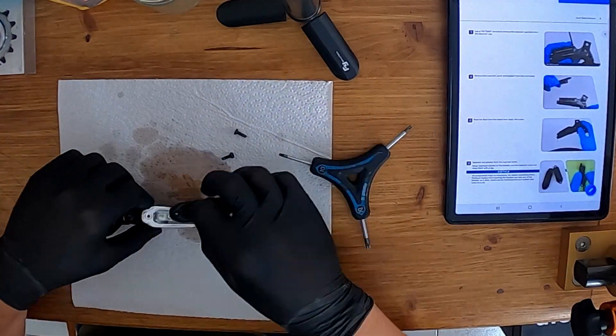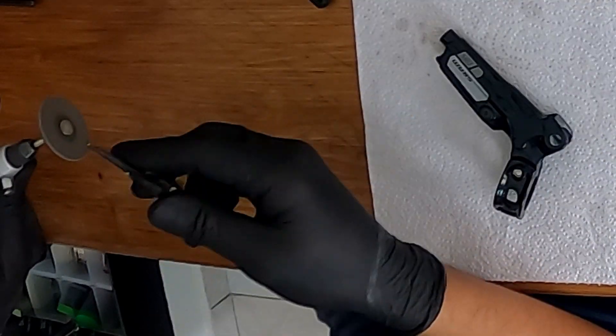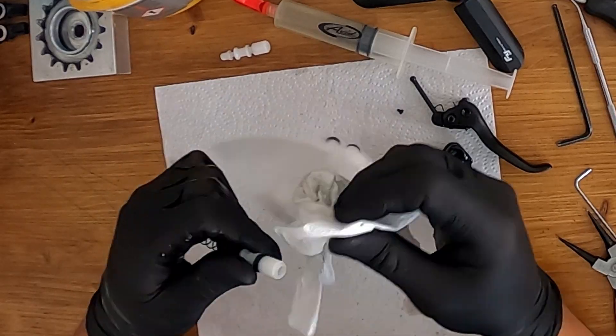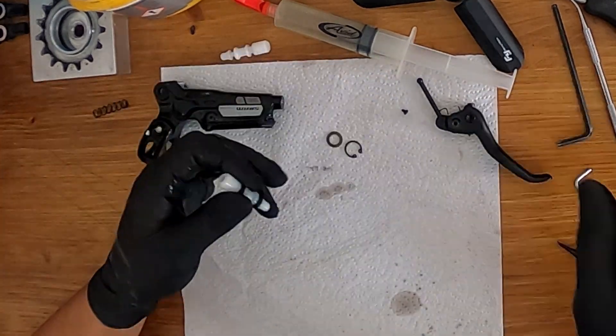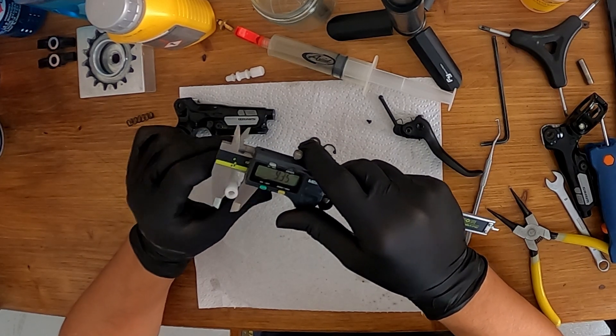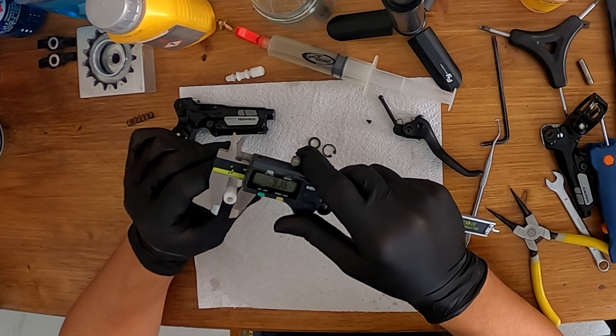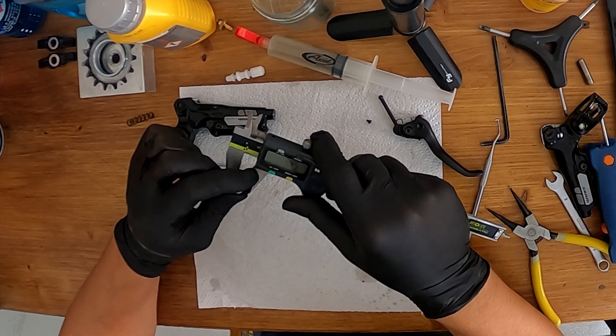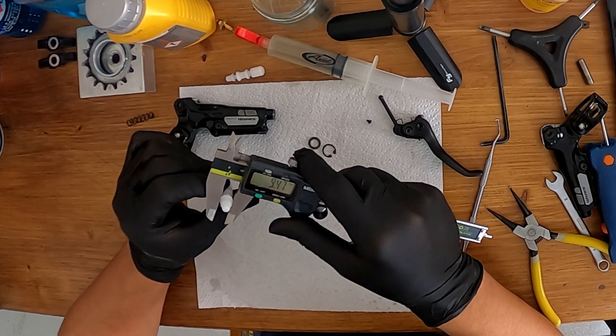So I decided to take everything apart and I was surprised that I had to modify some of my tools to manage to take the piston apart. I saw that the problem was caused by the piston, which seemed quite sticky — this could be caused either by the seals or the piston itself. After examining all the bits and pieces of the lever I realized that the problem had been caused by the piston itself, as the seals were still as good as new. The piston material had been swollen by absorbing either oil or humidity over the years it was not in use, which could be verified by measuring the diameter of the piston where its major diameter comes close to the walls of the piston chamber.